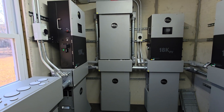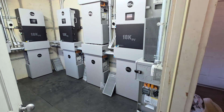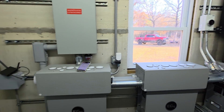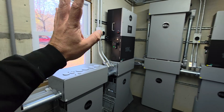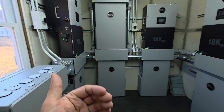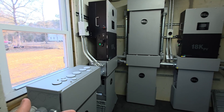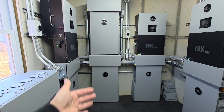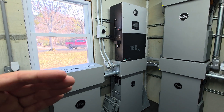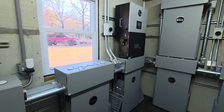When it comes to scale, this is a very large room filled to the brim with batteries and inverters. It gets very warm and I have an AC unit for this room specifically, plus Wi-Fi to run information back to the house. If you don't have this room, where would you mount the batteries outside? Planning spatially where this equipment would go is another key step. You also need to understand how much space is available for the solar itself — whether it's on a roof, and if so, you have to derate the solar based on pitch, orientation relative to south, and your latitude.